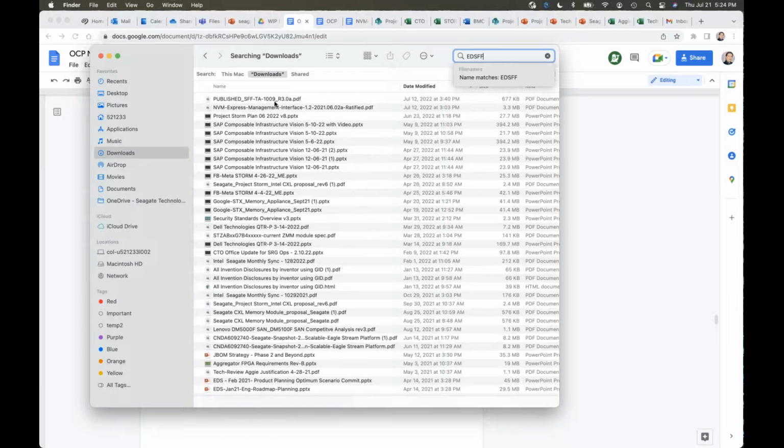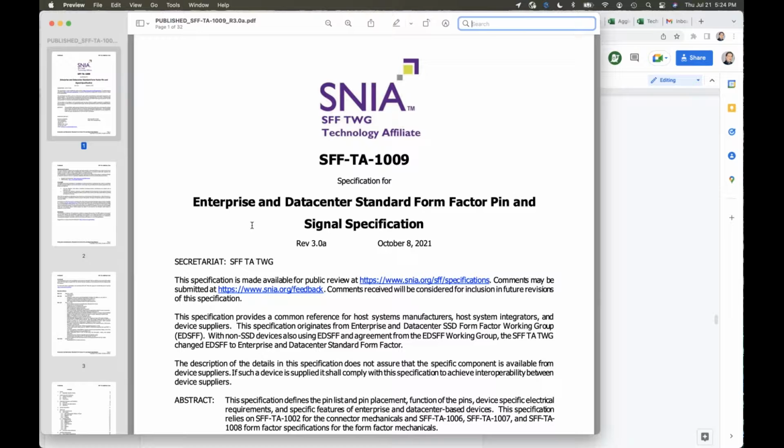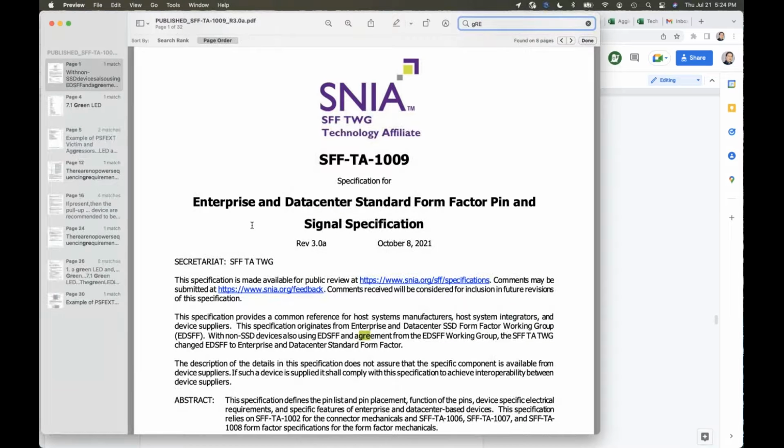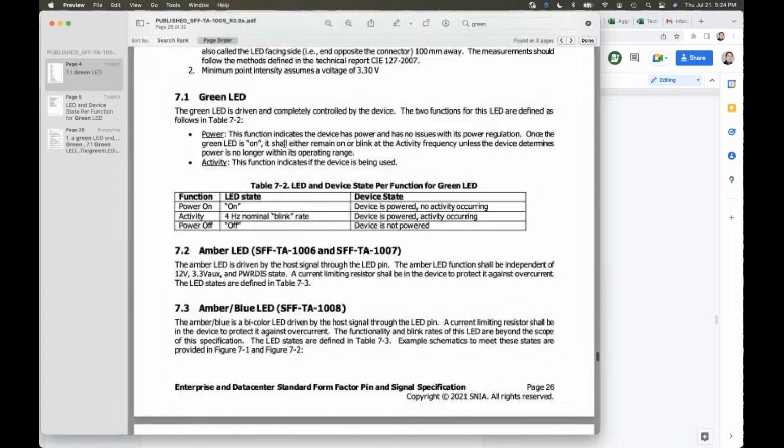Yeah, so Patrick, I think part of this might be the EDSFF drive. The activity LED is on the drive itself, right? So it's on the device, so it doesn't come out of the device. But given that this is a 3.5-inch HDD form factor, the activity LED for any platform with the 3.5-inch drive is driven back by the device into the chassis, right? That's where the activity LED goes. So really the question here is, do we not have one? In which case, on any tri-mode platform, let's say you have a backplane design that accepts SAS, SATA, and this NVMe drive, you would have an activity LED for SAS and SATA, but you put an NVMe or an NVMe HDD in there, you get nothing, right? Now, whether you use it or not really doesn't matter, right?